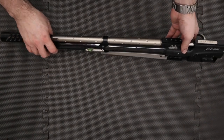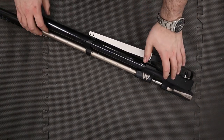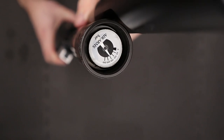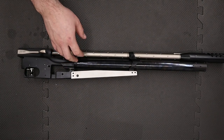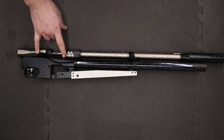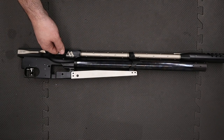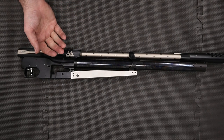With that done the next thing is to get the rifle re-pressurized. We've left the rifle cocked so touching the trigger will fire it, but that's on purpose as we may need to cock it to fill from empty. With about 150 bar of air in the rifle it's no longer leaking straight to atmosphere, so the regulator has been fixed. We've also put the rifle over the chronograph and it's chronoing nicely at roughly the same power. If you needed to adjust the power, there's a venturi adjustment on this side covered by a small screw — remove that with a two millimeter allen key and then use a 1.5 mil allen key to adjust the venturi inside, which blocks and unblocks the transfer port to get your desired power.